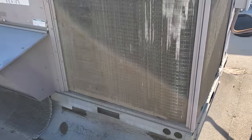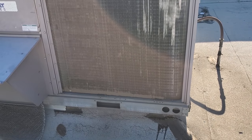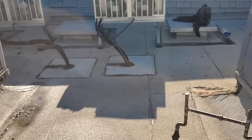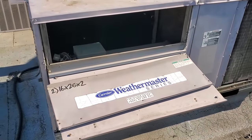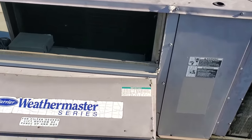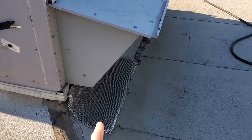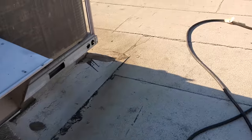Today we're going to start by cleaning the unit because I know it needs to be cleaned. I pulled the filters out yesterday, so we're going to do this for two different ACs. We've got an office AC right here too — it's not horrendous, but it's actually pretty dirty. It's just got grease all over it. So we're going to clean and sanitize the evaporator and clean this unit up. We'll get them a list of things — they obviously need a metal mesh filter.